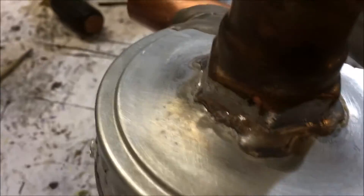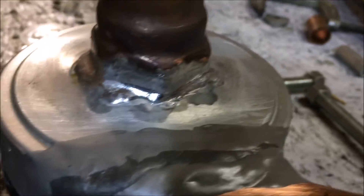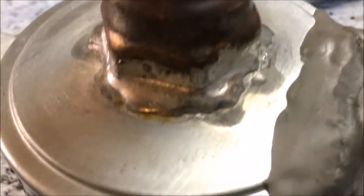I'm impressed with how quickly it heats copper up. I do think there is some kind of weird copper-acetone reaction going on, I don't know, but anyway it was able to quickly and easily heat this piece up no problem. I'm now going to solder these vents closed.